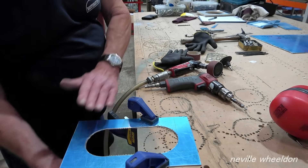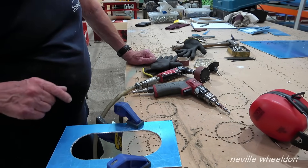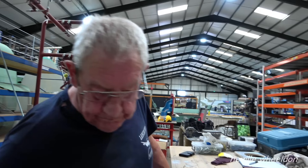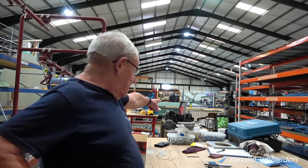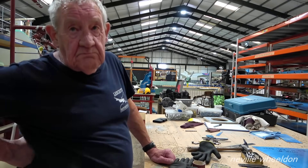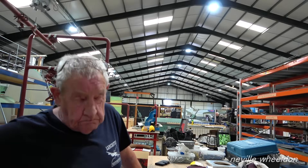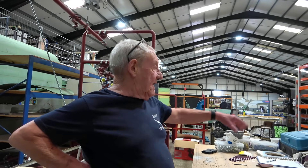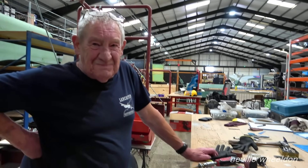This is the vacuum plate. And then I'll make the wood, get the hole in, shape it in. And then I'll get the material - there's 25 thou in this case. Put the hole out and then form it into the wood. Similar to that, same principle. So you can crack on making the bits further on with the ribs. And this is for the trailing edge. But they can also get used for other ribs. They're not just specifically for that - if they'll match another one and they need one, then we'll use them. So the pattern is good for anything on the Lancaster. That's good. Thanks Dennis.